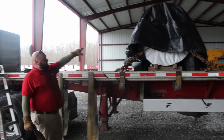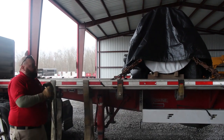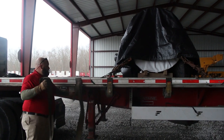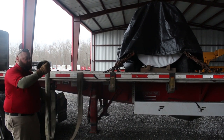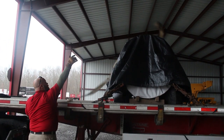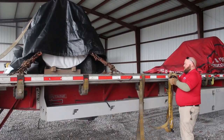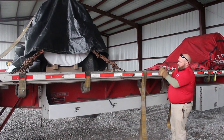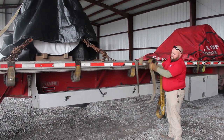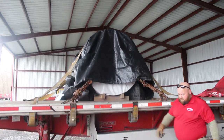You put your black tarp on because this is our little rain jacket — our security feature to make sure our coils don't get wet. Now we've got to throw our two straps X across the top, and what that's going to do is create a skeleton form that will hold up our red tarp. A little trick: when you're throwing your straps and you want them to unroll right every time, roll them up, give it a little loop, and go straight across every time.